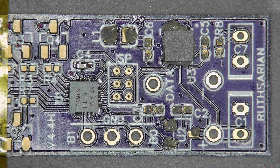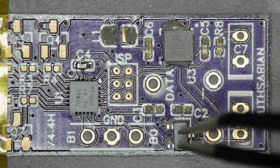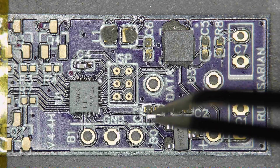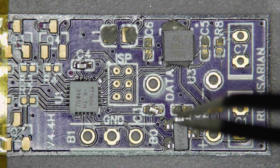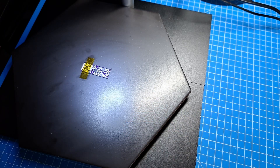Now we have all the other components that need to go on there. Next I'll grab one of these voltage regulators for the microcontroller. Now I'm going to grab two 1µF capacitors that go with the smaller voltage regulator. It looks like I might have some flux on the end of my tweezers that are causing components to stick — that can sometimes be helpful, sometimes it can be a hindrance. So I'm going to clean those off with a little IPA.